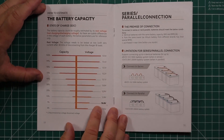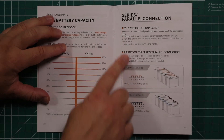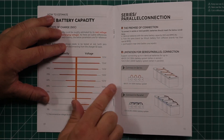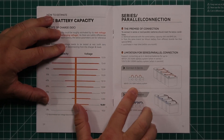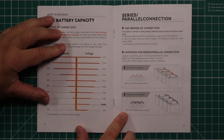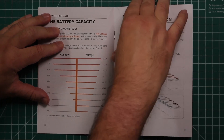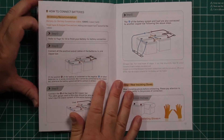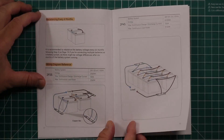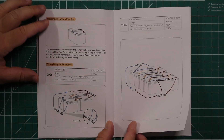They give you a chart for the battery's capacity voltage, and they show you how to hook the batteries up in either series or parallel. In series, you'll get 48 volts at 50 amp hours. In parallel, you'll have 12 volts with 200 amp hours, and you can hook up to four. They also show you how to connect everything and talk about rebalancing the batteries every six months if you have them hooked up that way.